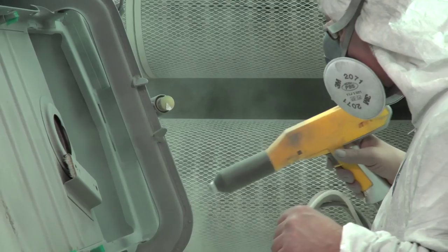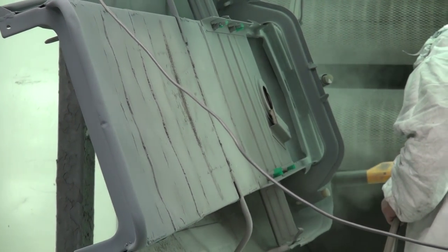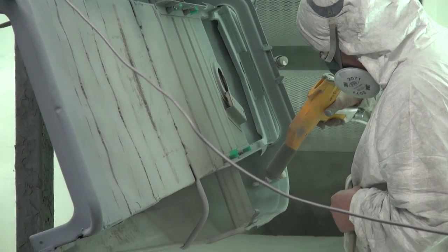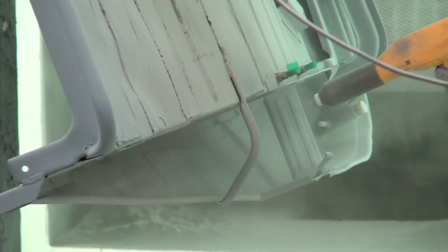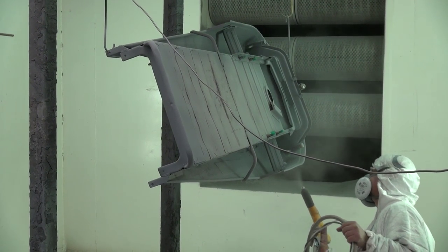It's amazing that you can stand this close to a paint booth without having the doors closed or needing a respirator — you can't even smell it. Most paint booths close right up with major ventilation systems. Powder coating is environmentally friendly — there are no VOCs in it, so it is the paint of the future. The sound you hear is air being pushed backwards through the filters; it drops into the hopper at the bottom and about once a week we empty it, put it in the oven to turn it into a solid, and then it can be disposed of in the garbage.